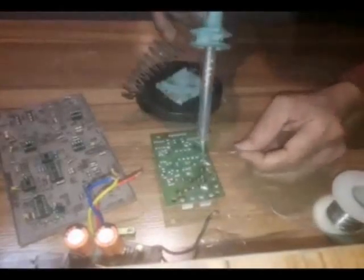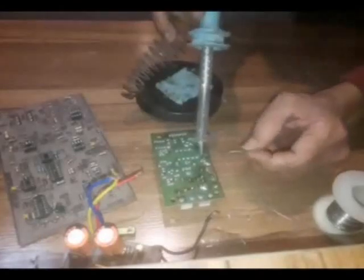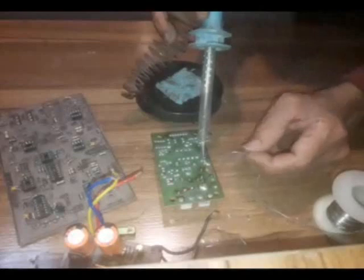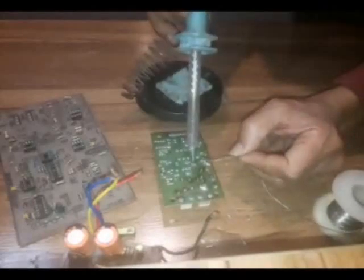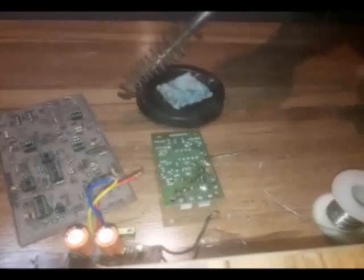When you heat the soldering wire, this action can cause oxide to form on the tip of the soldering iron. As a result, when lead accumulation exceeds a certain limit, it will cause defects in soldering operations and temperature transfer. It is necessary to periodically clean the tip of your soldering iron using a brush or sponge.